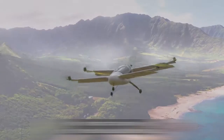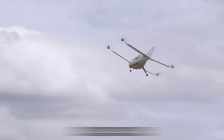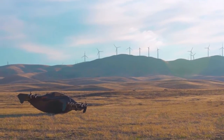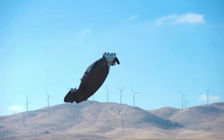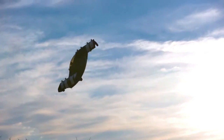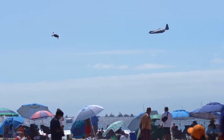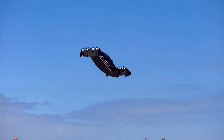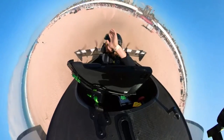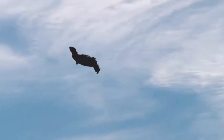It is very rare that an aircraft comes along and blows you away with the simplicity of design. Perhaps the last time we witnessed it was in the case of Opener's Blackfly, an EVTOL which took out the complexity of tilt rotor and tilt wing mechanism and presented a new concept of an automatic tilting body for vertical takeoff and landing. Because it was a pure VTOL, the Blackfly didn't have landing gear — it just had a rub strip on its belly. This simple tilting body concept resulted in a lower weight of the aircraft which enhanced its performance, particularly when compared to other single-seater battery-powered multi-copters.